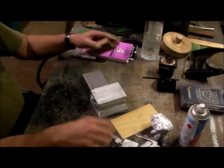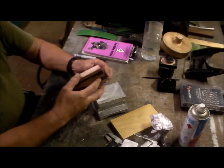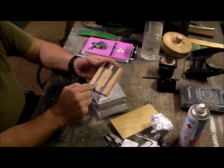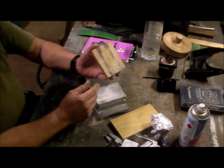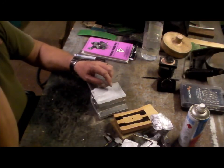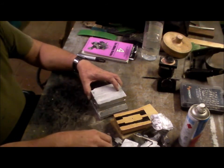That's the pattern. I'll make another block on the top of this, pin it in with two nails, cut the corners out, chamfer all the edges, and this will be a split pattern. That's tomorrow's job. So actually, out of the five castings there's really only one that I'll be redoing. And I really don't have to do that. So what looked like a disaster wasn't a total disaster.